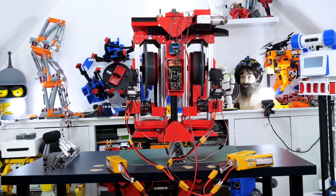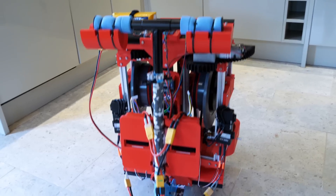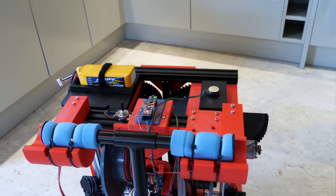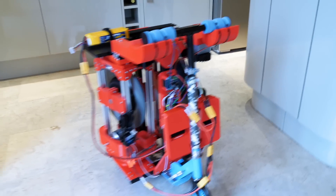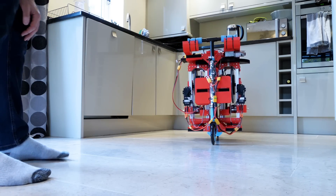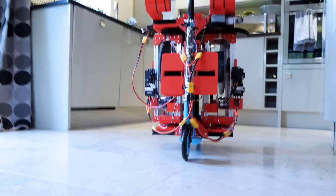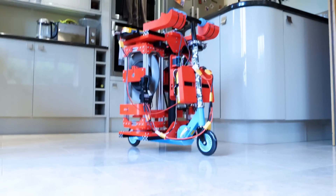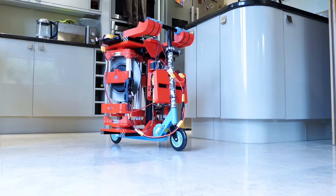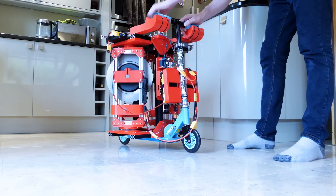I'm pretty happy that it can just about balance — but what can we put it on that's a bit more fun? Yes, it's a scooter! I fixed it to the handlebars with some brackets and it's just sat on the kick plate, and that seems to be balancing all right. I put the battery off-centre to help balance up the other side where the control axis motor is, so it balances pretty much in the middle by itself, but obviously it needs the gyros to stay upright. Now I can slide this along and you can see it's clearly balancing on two inline wheels. If I'd motorized the back wheel and had a servo on the steering I could probably drive the whole thing along by radio control. There are some oscillations and it will need retuning based on whatever I put it on — wherever that pivot point is I'll need to retune the PID controller — but if I leave it alone for long enough it seems to settle. And if I give it a shove you can see those gyros in the control axis compensating, uncannily pushing itself upright again. So it can exert quite a lot of force and I'm pretty confident we could use this on a walking robot.